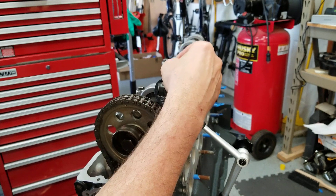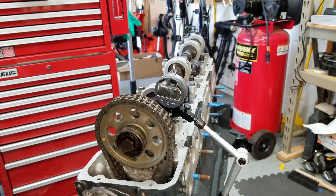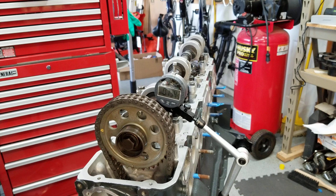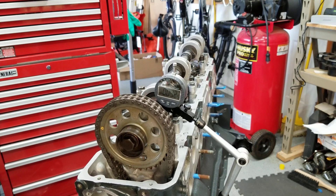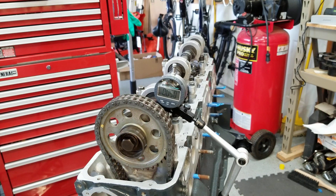I'm still touching the valve retainer, which is good. Now shooting for 51 thousandths on the closing side. There's 50 — I'm measuring 73 degrees. So I have 140 on one side and 73 on the other. That's 213 total, divided by 2 is 106.5 degrees. So I'm about two and a half degrees advanced compared to the spec of 109 degrees after top dead center.